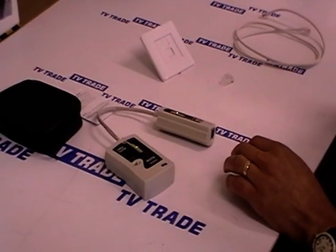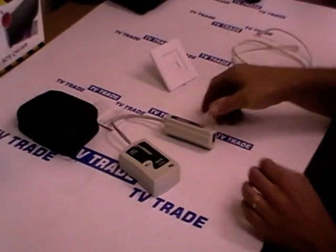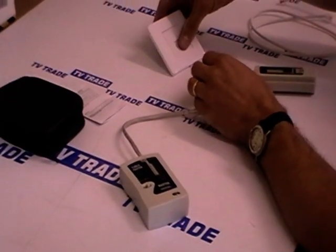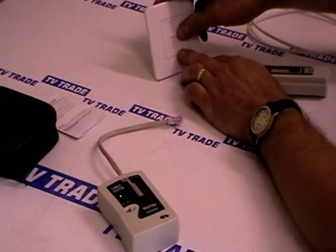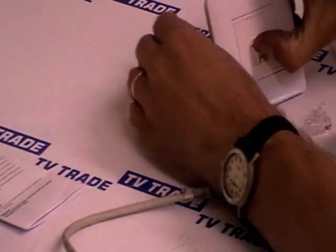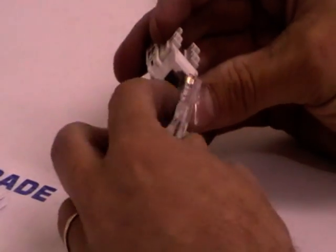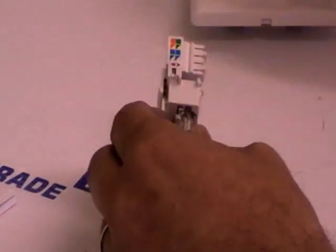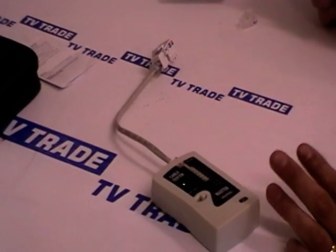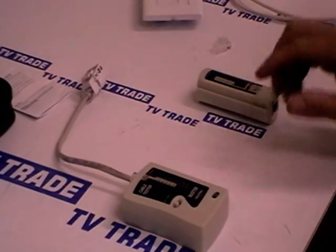Another very useful feature is that not only can we use it to test cables that we're running from A to B, we can also use it to test cables in the wall. What we'll do is disconnect this unit, and we'll pretend this is a phone jack actually in a wall — a LAN distribution network. Behind it we'd have a Cat5 RJ45 jack port, and we hook the jack into it like this. On the far end of the cable that goes through the wall, we'd have a similar cable coming out with the remote unit. Then we run our test again to check if the cable in the wall is following the sequence we want. So this is a very, very simple unit.